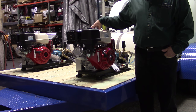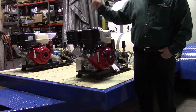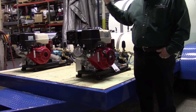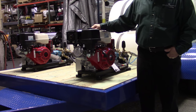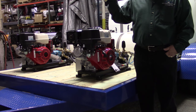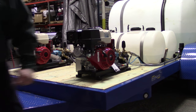What's nice about this with a two-man team: one worker would be applying the step one to a side of the trailer, and another guy follows right behind within about 20 or 30 seconds and can hit the number two. It depends on your dwell time and how dirty the truck is. At that point they can both rinse, using the downstream inject for rinsing as well.